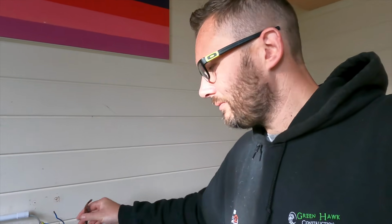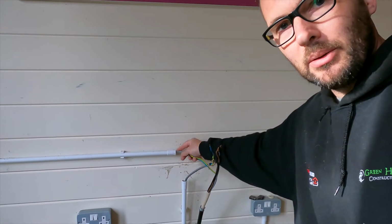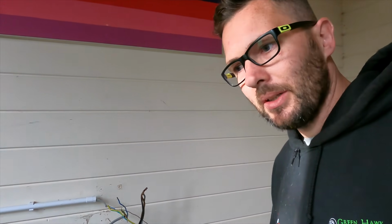I had already, on Friday, a consumer unit ordered, and it was an actual garage fuse box board, but what I didn't realise is that the whole front cover, like the sides, comes off on the garage board. So I sent that back, so that delayed it. We got it all stripped out, ready to go. So I've reordered my boards, and I've got a four-way that gives you the normal, traditional full sides. In any other way it would have been fine, but because I've got conduit coming in from the side, it just wouldn't work, and I don't want to redo it all. So right, we'll get set up and we'll get the board out and start mounting it up.